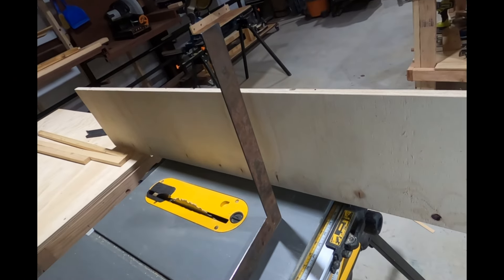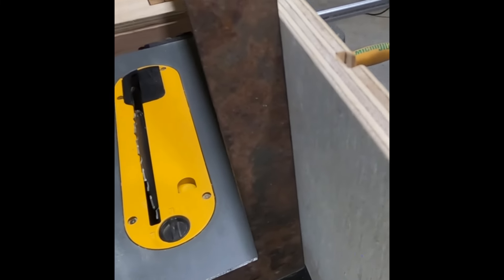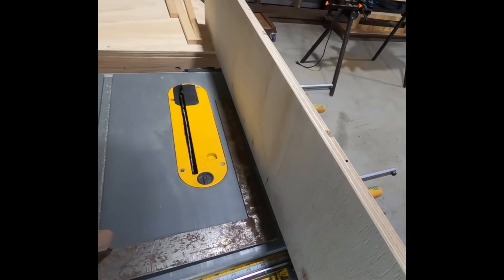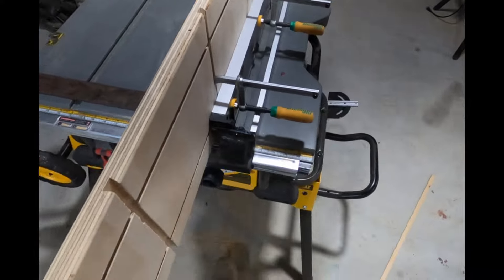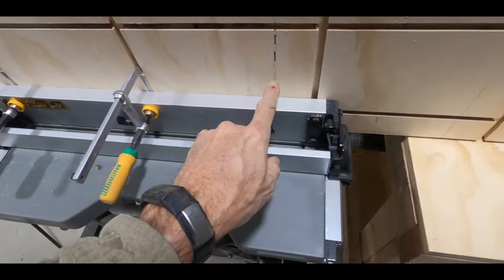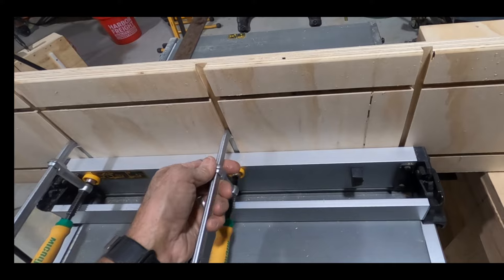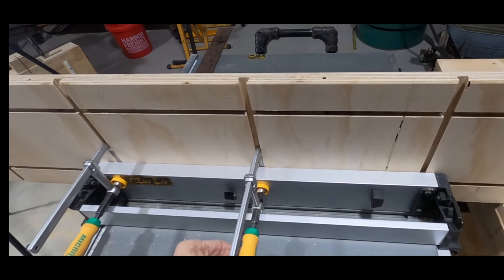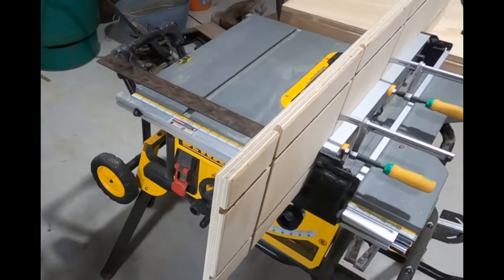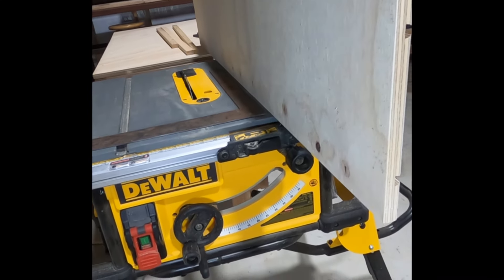The other part of this two-in-one jig is that it converts into a high fence by simply clamping it to the table saw fence. I clamped it in and it came up square, which was great. It's neat that with all the grooves on the back I can add additional clamping positions if needed. I was able to line it up with the fence and clamp it right down, and I can move the clamps around as needed — the Matchfit system is pretty versatile. I'd call this a success too, and I'm looking forward to using this high fence on future projects.